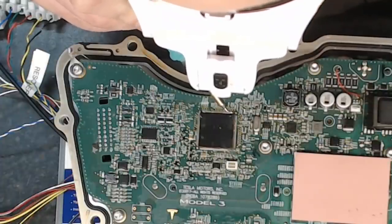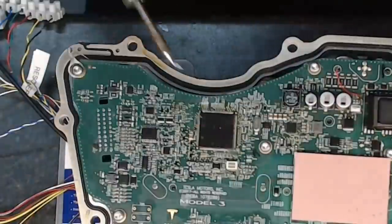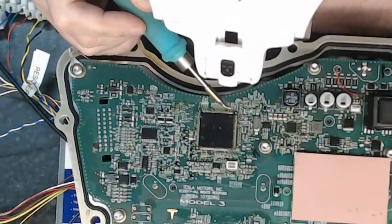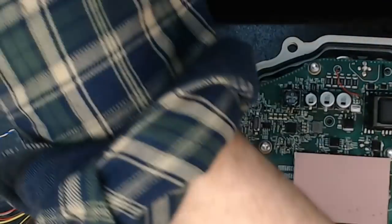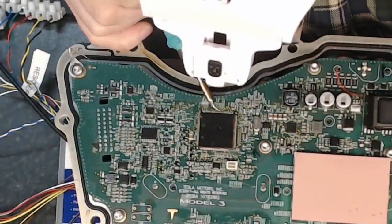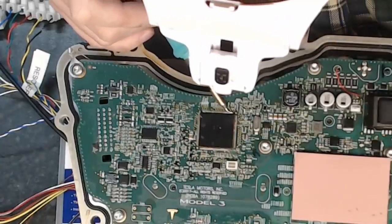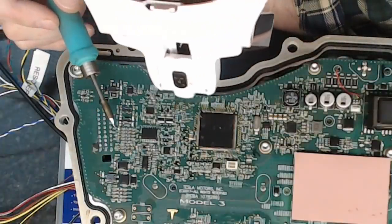Say, folks, it's a pretty rare thing that one of my ideas works, and that has worked. Absolutely, just cleaned off all those legs there without breaking any kind of a sweat. And I've only got the soldering iron set at about 320 degrees at the minute. So that's it. That side's done, basically.